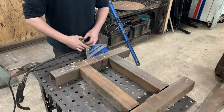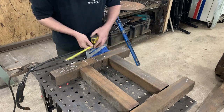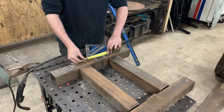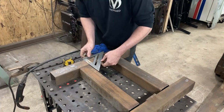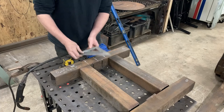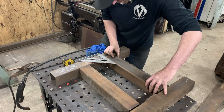The overall minimum here should be 5 and 3/4, and we are right at 5 and 3/4. We come in here, we know this tubing is square with that tubing and it's in the right location. We can come back here, square off that edge, move those in — right around there.